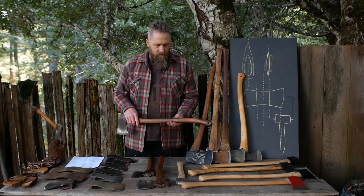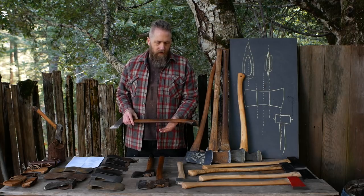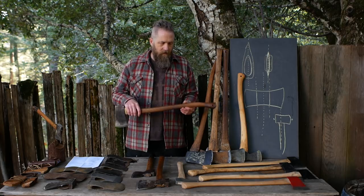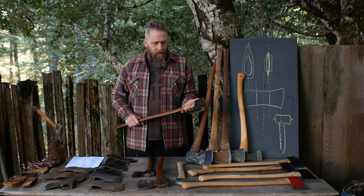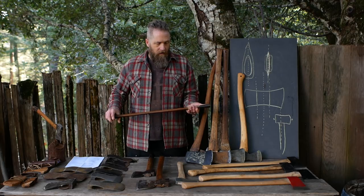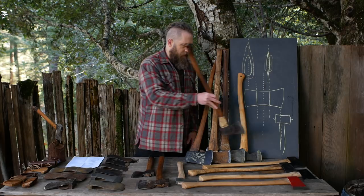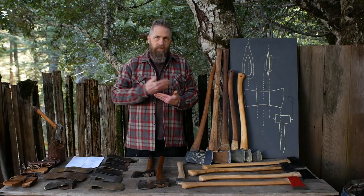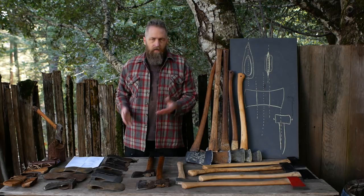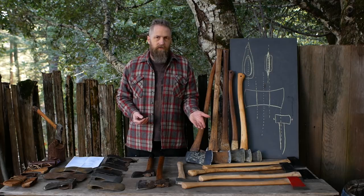That can cause instability — warping and twisting. This piece was a little twisted; I re-carved it and steamed and straightened it. However, wood quality is more important than any of that. This hickory is really tough and nice — when I bought it, it was all bashed up and broken inside the head from hard use, yet they didn't manage to break the handle in that weak area. If I'm picking out a new handle, I wouldn't pick one with this severe run-out, but I'd take it over a light, pithy piece of hickory.